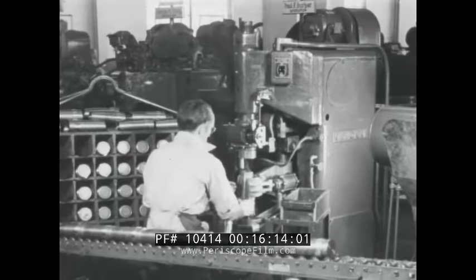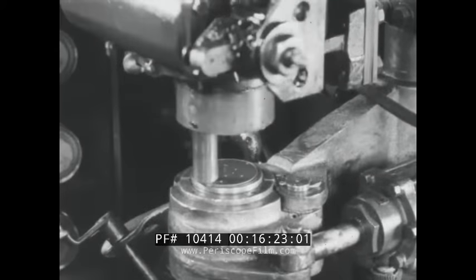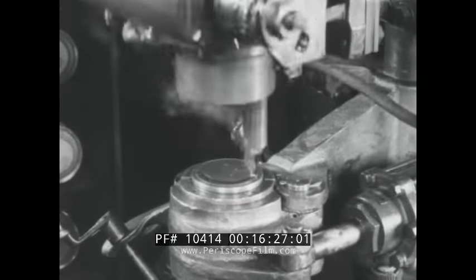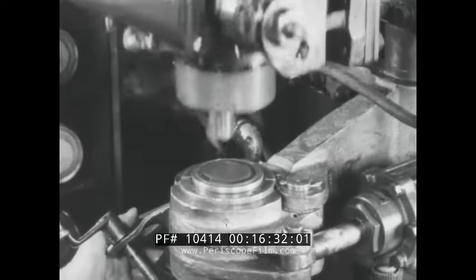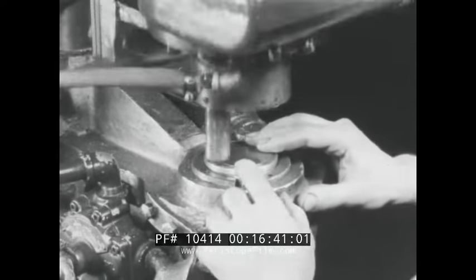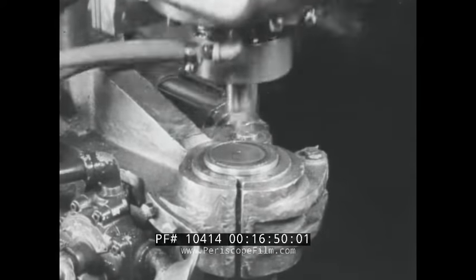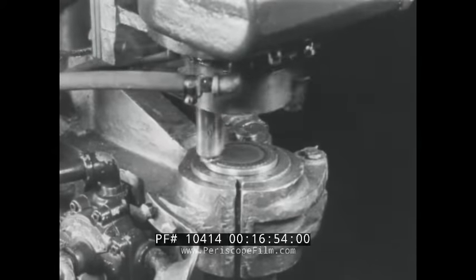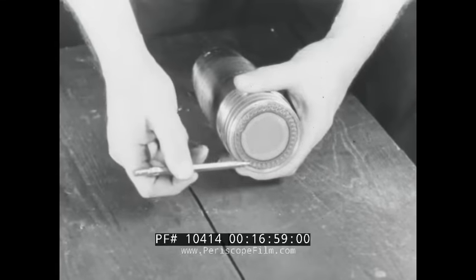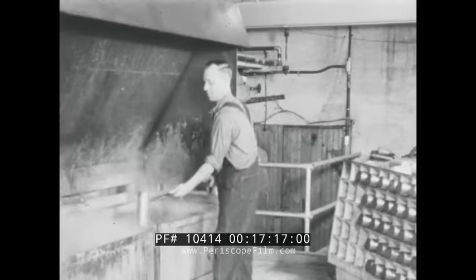After the band has been turned on the shell, it is placed in an electric welding machine where a steel disc is welded to the base of the shell. It will be noted that the disc is securely attached to the base by an overlapping spot weld. After the shell has had the base cover applied, it is washed in a hot soda bath. It is then rinsed in clear hot water to remove all grease, dirt, and other foreign matter.